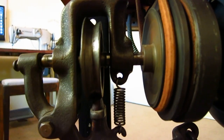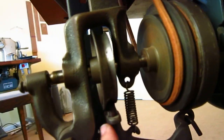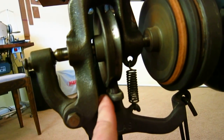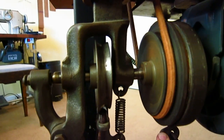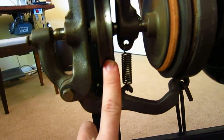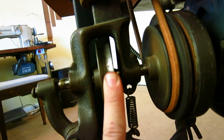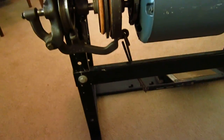There's actually a little piece of leather down here that you can change out. There's leather in here that loops around over the top of this. So when you're sewing and you're depressing the pedal and you want to hit the brake — basically when you let go, this arm comes up and pushes against the brake pulley, and the brake pulley will stop the entire motion. That's how the brake works.